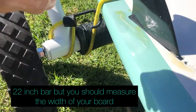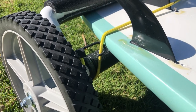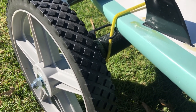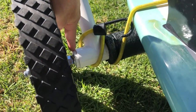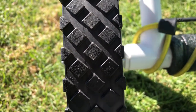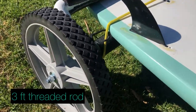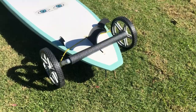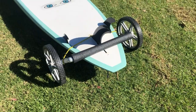This is a T section. Yeah, it's pretty easy — you just glue it in there. Make sure it's secure with that fast cement glue. And then you gotta drill that cap in there, glue it in through this join right here. Put that locking washer on, hex nut here. I didn't even have to cut the rod — it came in a three-foot length. So this is actually a three-foot threaded rod, and that's the length of this SUP cart.